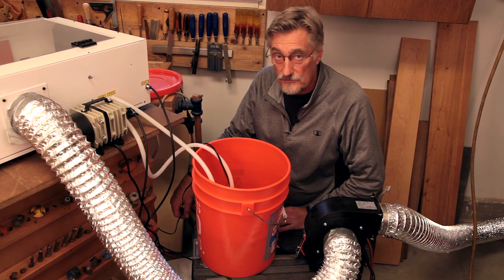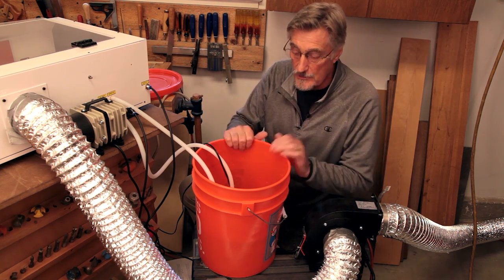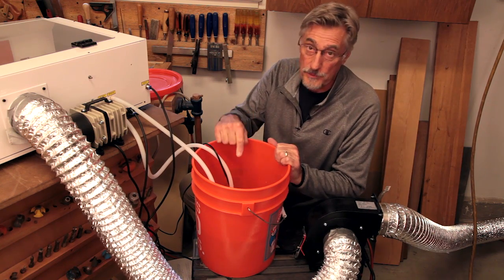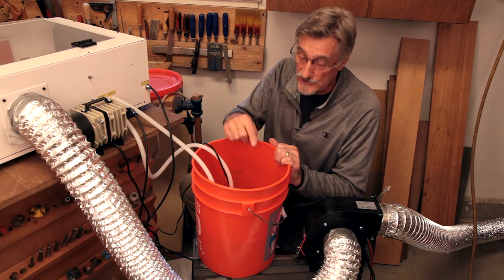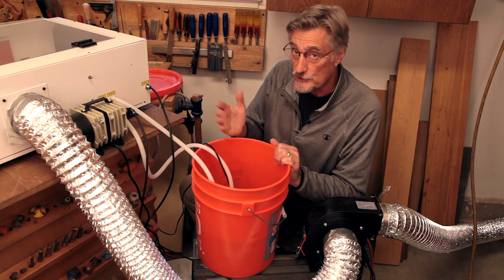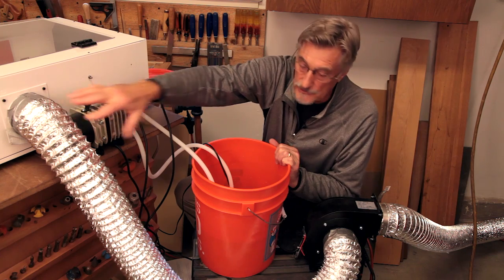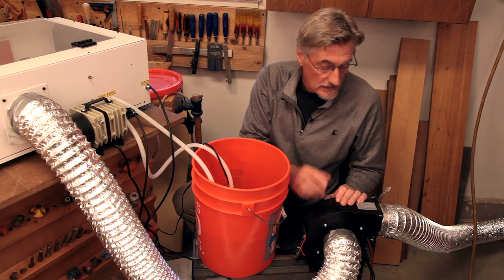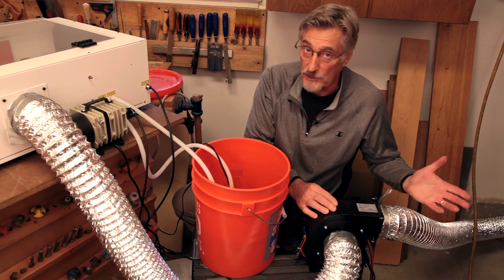A laser powerful enough to cut materials gets really hot, and this is a double wall tube that's continually cooled by distilled water in this bucket. There's a pump here, it runs water here, and it returns back into the bucket. It doesn't get really hot inside the bucket. The laser also creates smoke because it's burning or melting materials. So this duct here is connected to a scroll cage fan, and that runs out to a dryer duct. You could just hang this hose out a window if you don't have a dryer duct in your shop.